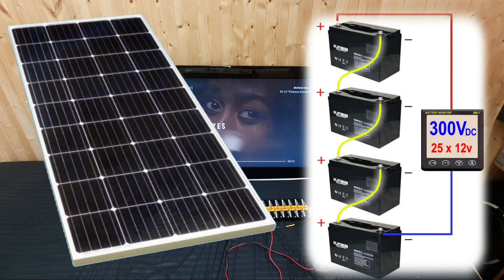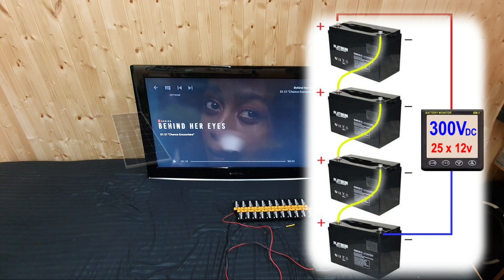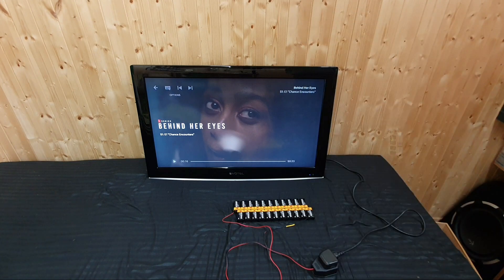In actual fact, this voltage is far below what it should run at, because the equivalent DC voltage of 230 volts would be 315–330 volts. We're only doing a DC voltage of about 210, which would be similar to America's 120 volts rectified to DC. Modern appliances, because they have to work in different parts of the world, can work on a wide variety of voltages, so you don't even have to be that worried about getting your battery pack voltage spot on — it doesn't need much regulation.